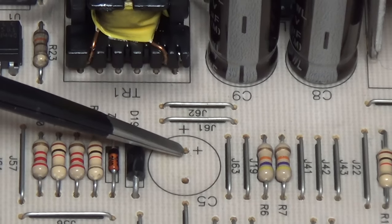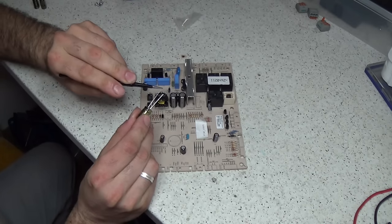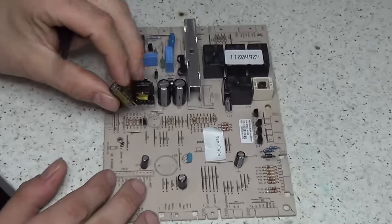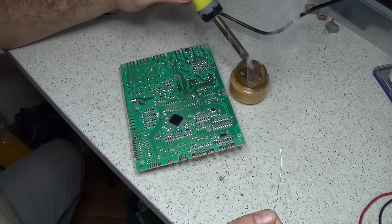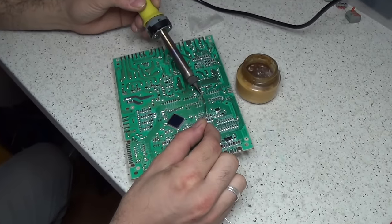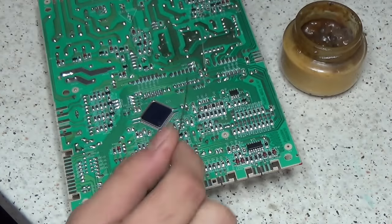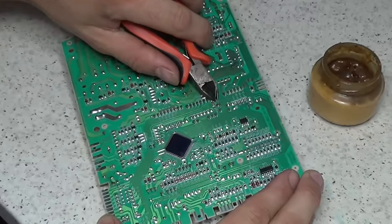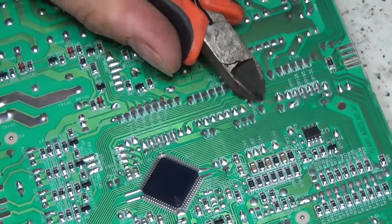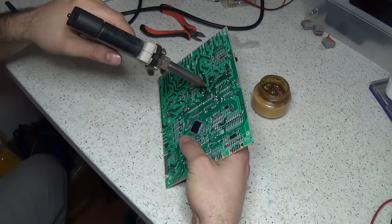When you're fitting a new capacitor on the circuit board, you should see a plus and a minus. The minus is normally showing on the side of the capacitor. The longer leg on the capacitor is normally the positive. Just fit it into the board, turn it over, and now you need to solder it on. With these test meters for checking diodes, resistors and capacitors, they're very useful for checking all the chips on the circuit board. Sometimes you will need to desolder the old chips to take them off to test them because you won't be able to test them in line.